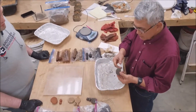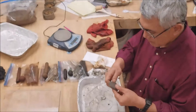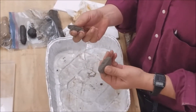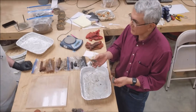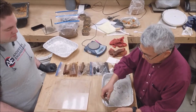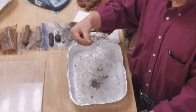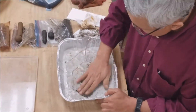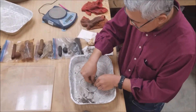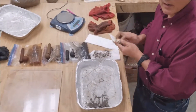So we're going to do the breaking test or the crushing test. We prepared a cookie — again, this could have been a piece of dirt on the ground — and we're going to measure how much strength it requires to break. With a nominal amount of effort I was able to break it in half, about the same as a Nabisco cookie, a dry cookie. Not very much effort. You could take a small piece and crush it — pretty easy to break. Or you could use a sugar cube like we did, which may be a little harder, but still very easy. Not much effort. So we know that's a silt.